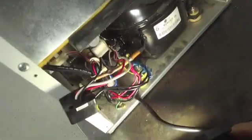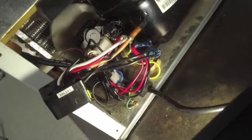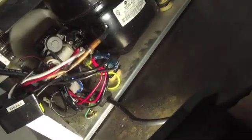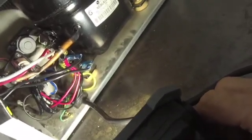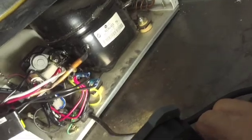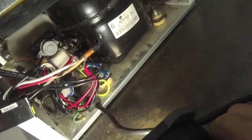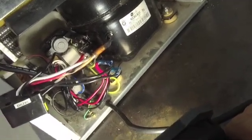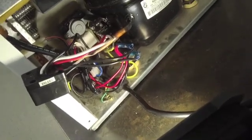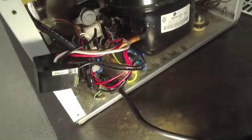And it does start, but it's drawing too many amps. You can see the condenser fan motor back there — it looks like a little evaporator motor, but that's on. It's drawing 4 amps, and 4 amps is way too high. Even a third horsepower compressor only runs about 3 to 3.5 amps. So there's definitely something wrong inside the compressor — probably the piston or something is causing friction and drawing more power. In a while this thing will start to overheat and kick out of the circuit. But that's how you put a relay on, and it's a quick way to check a compressor. Always check the amperage.